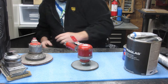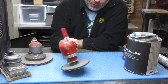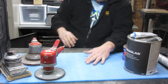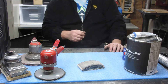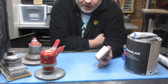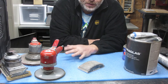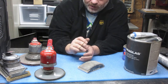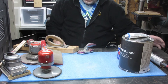What you should do — and I did some of — is finish everything off by hand. I was in a hurry and didn't do a ton of hand sanding, but if you haven't done it, it will turn into a huge mess if you try to do everything with pneumatic or electric sanders. You can buy electric versions of all these things. In the end, you should have a block and a hand sander.